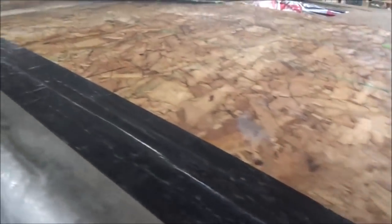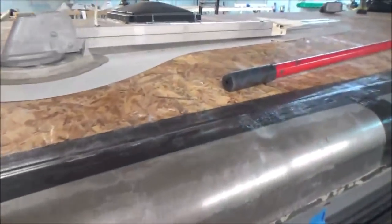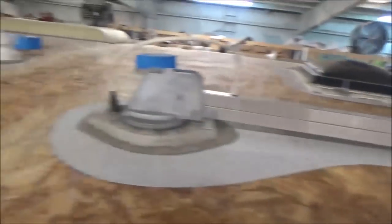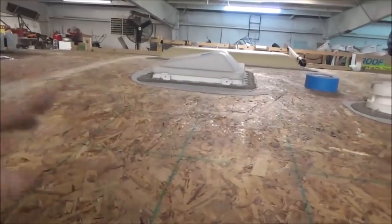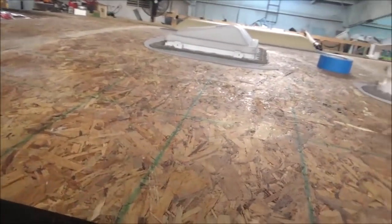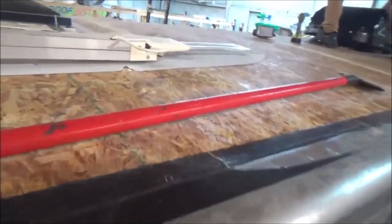You'll put silicone on there and think everything is okay, but it will have failed. You go back and rub it with your finger and that thing works loose. This is where we fixed the tape - right in here. There's this piece right here that's the top of the roof, and there's a piece of tape for this metal that comes out and returns up. That's what we did - we put more tape on that. We'll be back once we get the roof on. We got to get all these components off, but this is pretty much a straightforward job - take all the components off, clean them up, make the curbs, and put the roof down.